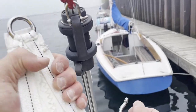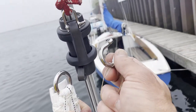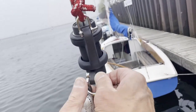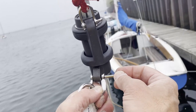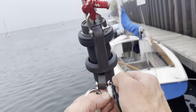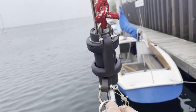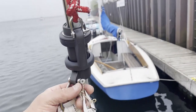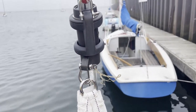The head of the sail is not much different. Here I've got the head of a sail, the bolt rope situated in the right direction. I've got the string on the shackle already wrapped around my ring finger, and I'm going to rig the shackle through the sail ring and start working that pin in place. When I have a few turns, that's the moment at which I can let go and finish up the job with my Leatherman. And that's how not to lose shackles on an ensign.